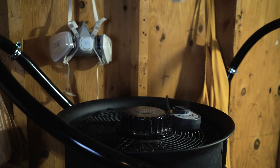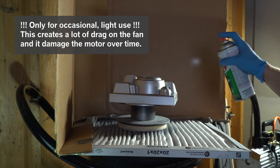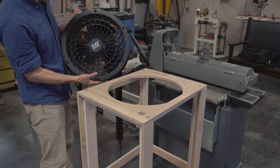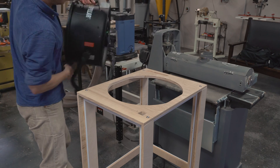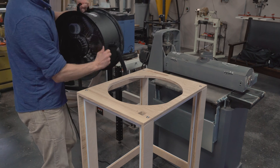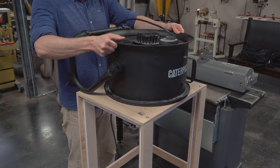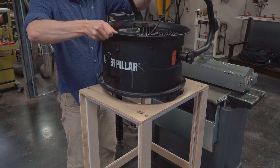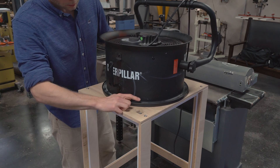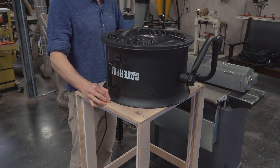It essentially works like a vacuum for the air. I personally use this method for cleaning parts, rags, filtering vapors, and I have even used it as a makeshift spray booth. For this particular configuration, the second fan option is in my opinion the only option because it has an enclosed motor. This prevents dust from accumulating inside of the motor. As you can see, the fan will get dirty if used in this way and it should be cleaned regularly. The Caterpillar drum fan is capable of being used to push air into the filter or pull air out of it.